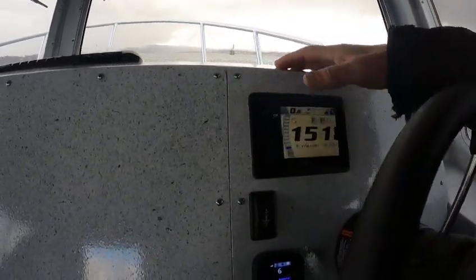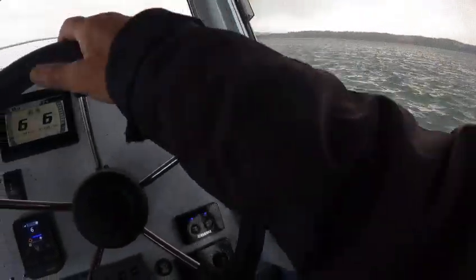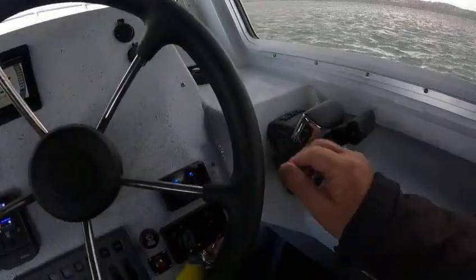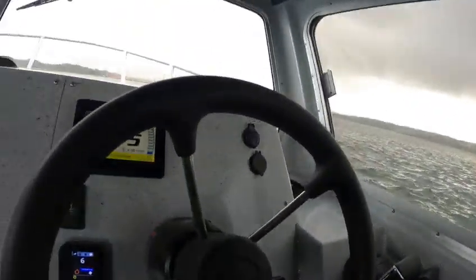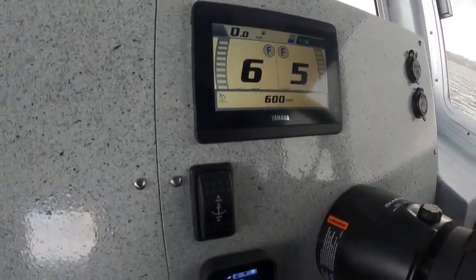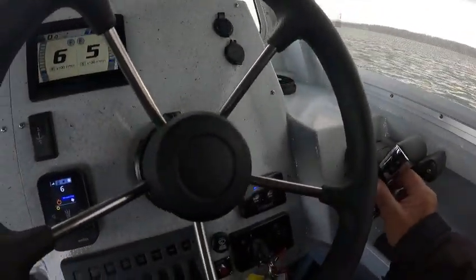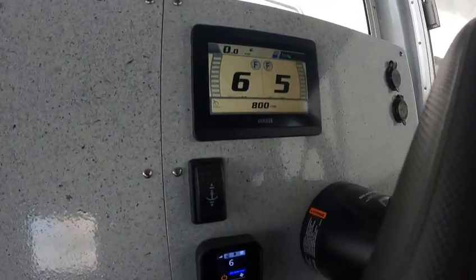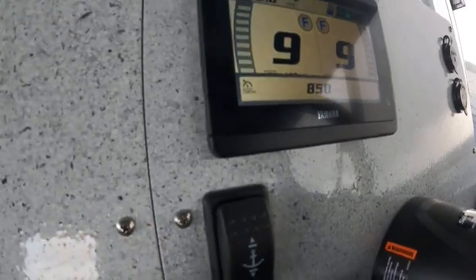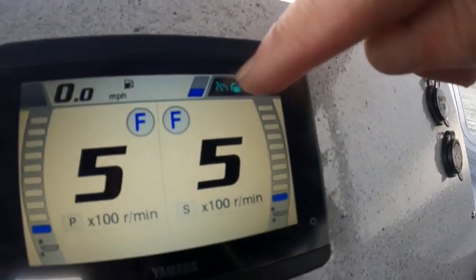I'm going to move this back over into here. If I bring this just into gear right here, I can hit this button and you'll hear a beep. Look down here — at 650 I can go to 600 RPM and it will hold 600 RPM. If I go up, I can go up to about 1100. If I really want to go slow I can get down to 500. See where it says 90 — it'll show you right up on the single lever that I've got cruise control on.